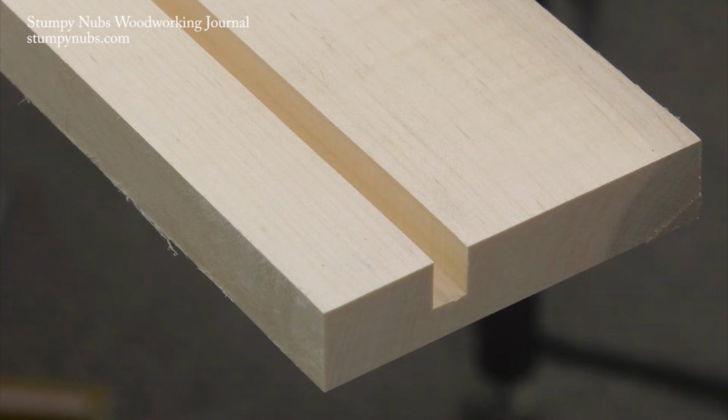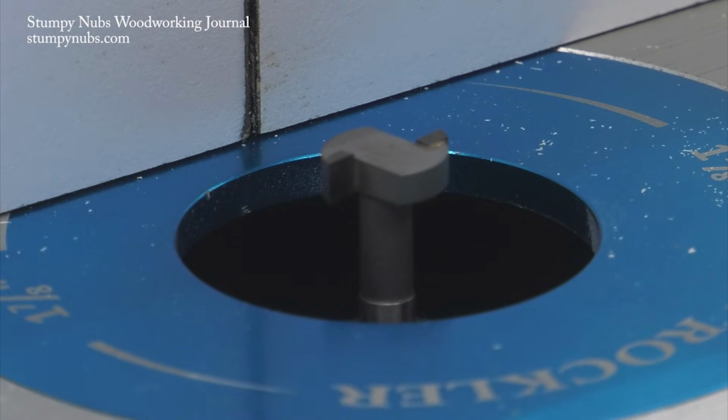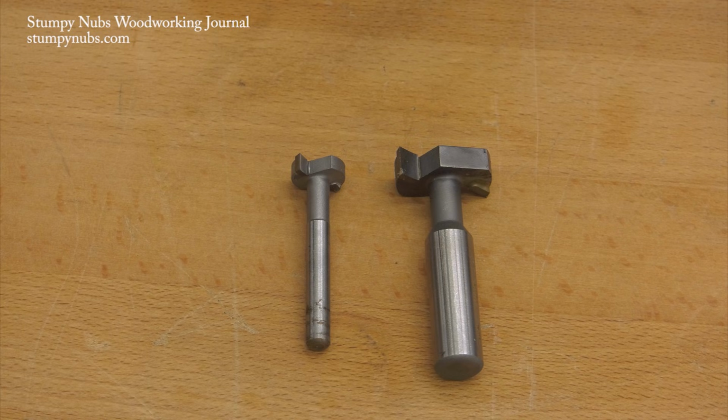After the initial groove is cut, swap over to your T-slot bit. Now I'm going to put a link to the ones I use in the description below this video. You'll find that a lot of them come in 2 sizes. I normally use the smaller one when I'm working with 3/4 inch thick hardwood. If I'm using thicker hardwood, then I would use the larger T-slot bit.